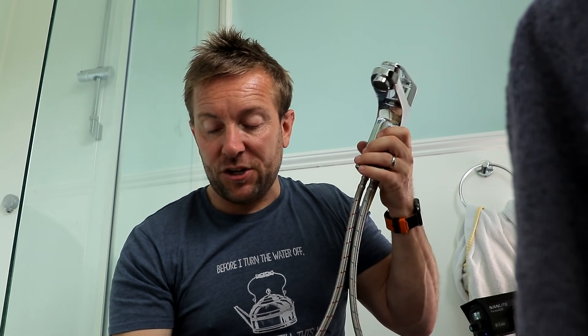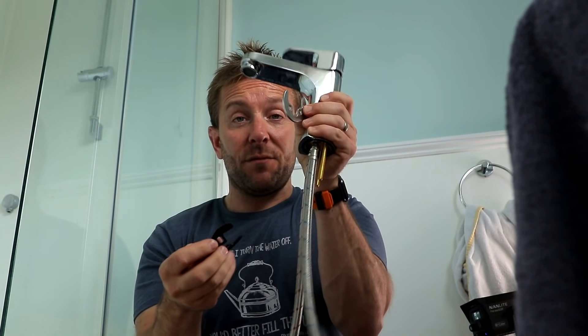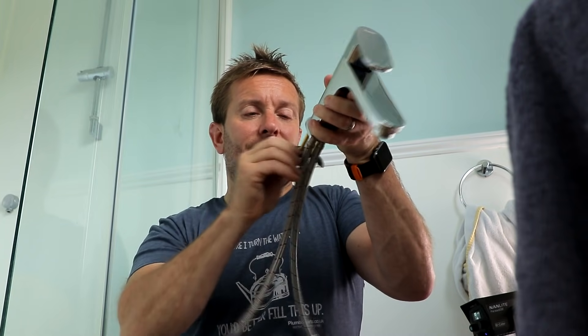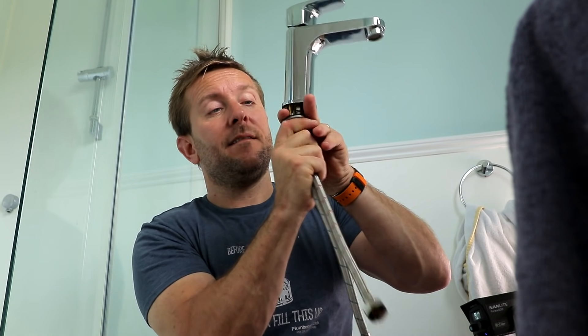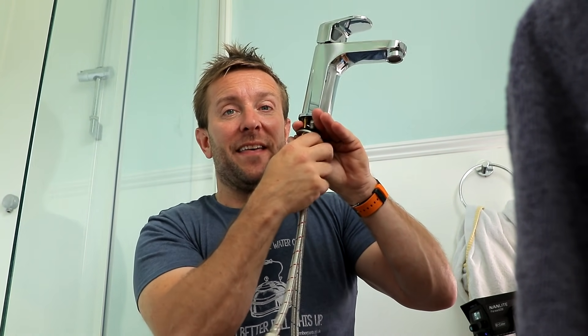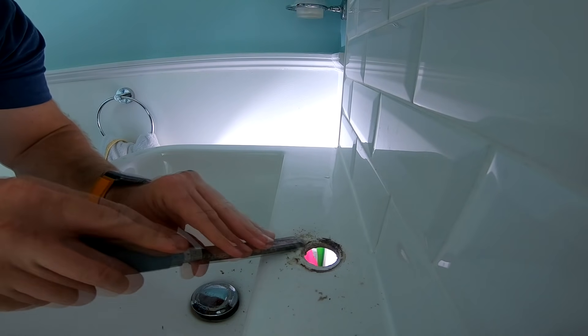Before we put that in, let's just get a quick recap on how these work. You've got a collar on the bottom - a metal collar - and then you've also got this small rubber collar on here. What happens is the rubber goes first, then the metal, around just like that. And if you imagine my fingers here as the basin, that's how we clamp it up. We're gonna go with our bolts all the way up here, and then we're gonna clamp the basin in that little bit there. Very simple to do - I say it's simple to do, it's actually a nightmare because you've got to get under the sink to do it.